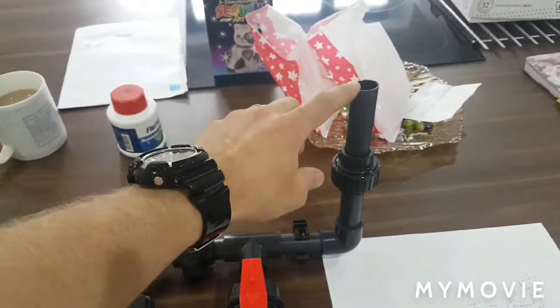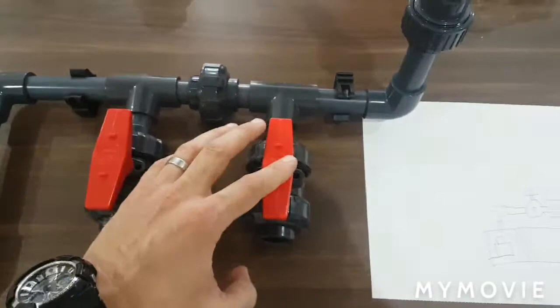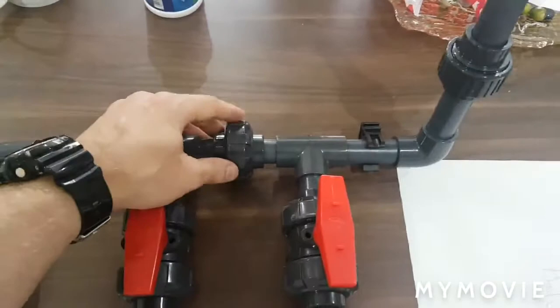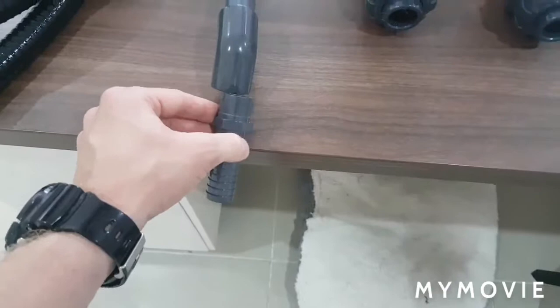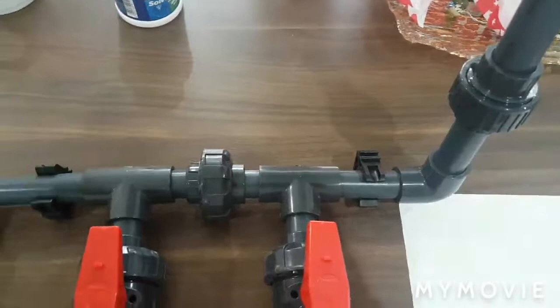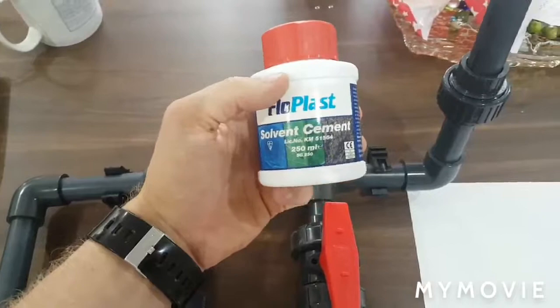As you can see, we've sort of stuck with the original drawing. This will be going up to the tank, down to my union, 45-degree elbow, a little hose clip there just to pin to the back wall, into the tee junction, into one of these ball valves — really high quality, can't recommend them enough — into another union, tee, ball valve, and then this bit here will go down to the pump through some 25mm flexible hose and onto my pump. The unions are in there so I can break it down and add bits if I need to.